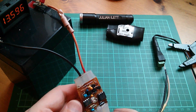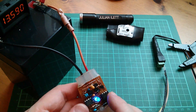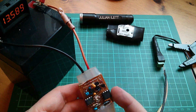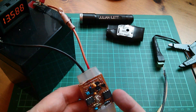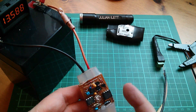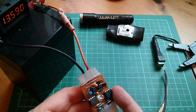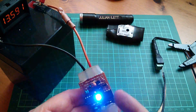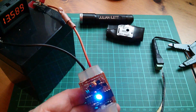The LED is on constantly, although flickering, and that indicates pulse width modulation. The MOSFET is no longer on permanently — it's mostly on, probably almost all on, but just with a very small amount of off time per cycle. The frequency is fixed at 122 Hz, and that's what the LED is indicating: holding the battery at this constant voltage.